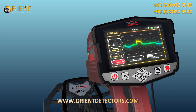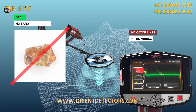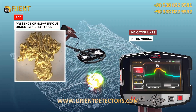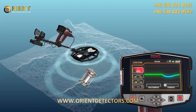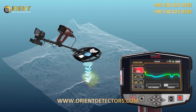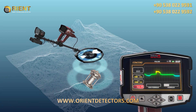The Pulse Induction System results display screen is a two-dimensional colored graph that changes according to the object that the PS50 search coil passes over. When the indicator lines are in the middle, they will appear in green, meaning no target object is found. When the indicator lines go up, the color changes to red, indicating the presence of target objects or non-ferrous objects such as gold. When the indicator lines drop to the bottom, they will appear in blue, indicating the presence of non-precious or ferrous objects. The level of the lines rising or falling is a measure of the strength of the signal received from the search coil. The lower part of the graph displays two indicators corresponding to the type of detected targets: the first in yellow for non-ferrous targets, and the second in gray for ferrous targets. The length changes according to the strength of the received signals.